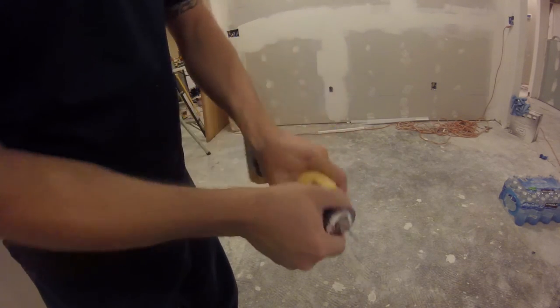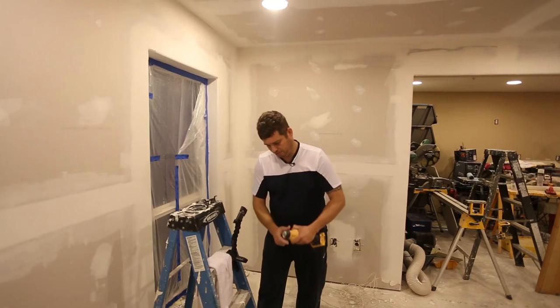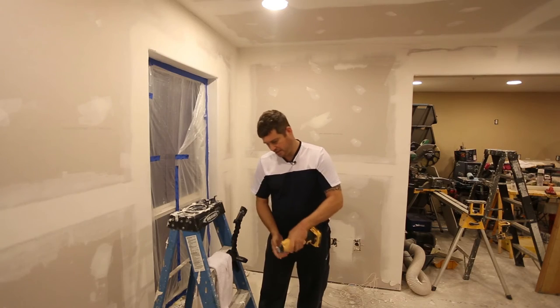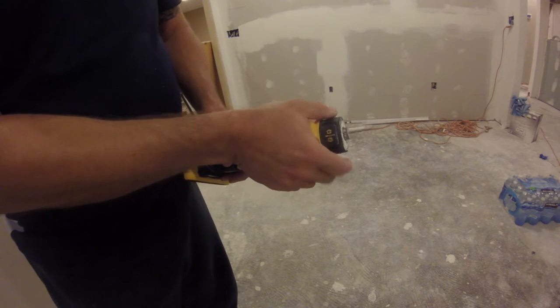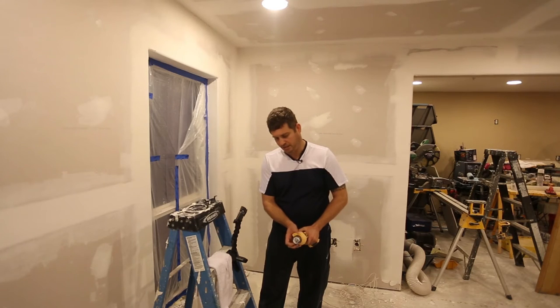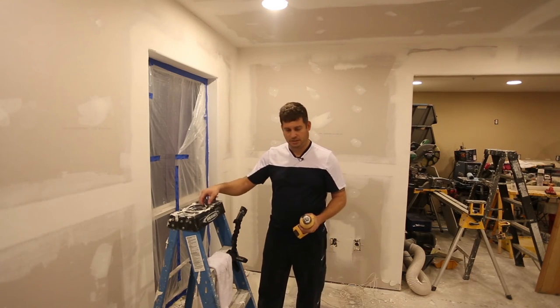Sometimes when you push the shaft lock it will stay engaged, so you just have to push it every time you grab the collet. You can see here it's engaged, and it's important to disengage this — you do that by just rocking it. If you don't, you'll have a surprise when you turn it on.